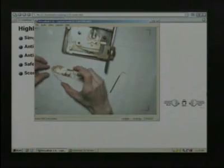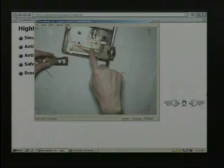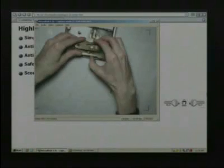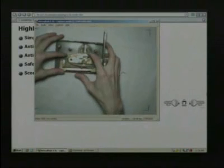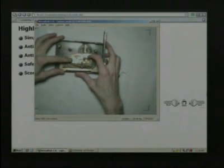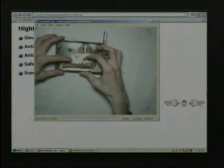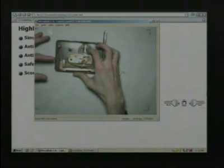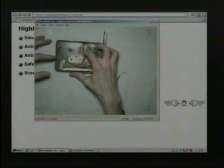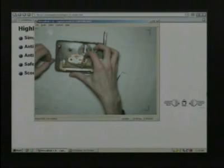As you can see, it's just a spring-loaded piece of brass, and the bolt here slides through the channel in the middle. Now, with that bolt, you have to move the lever to the right level. The key comes in here, pushes against here, and when it gets to the right level, the bolt's allowed to slide. If you're having to pick this, you're having to push each one, get the bolt to jam ever so slightly, and then the next one. These things are a right pain because there's a lot of tension on here.